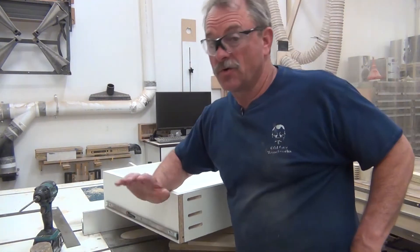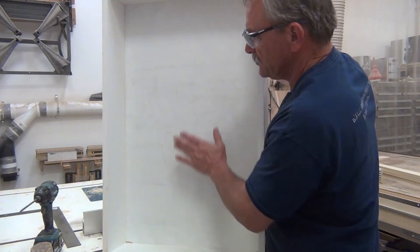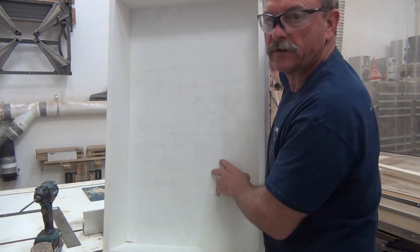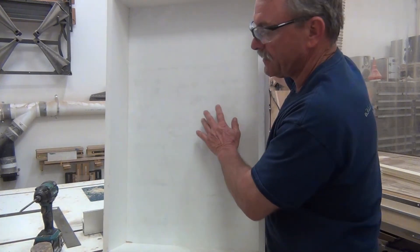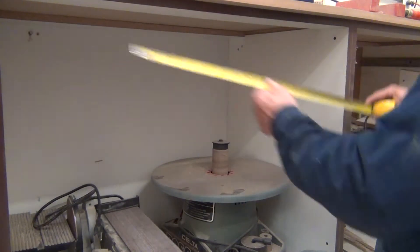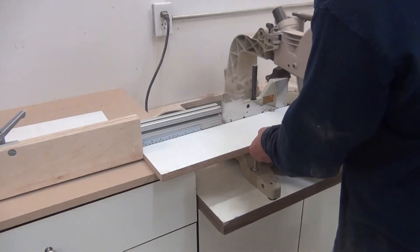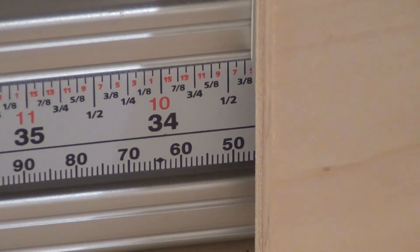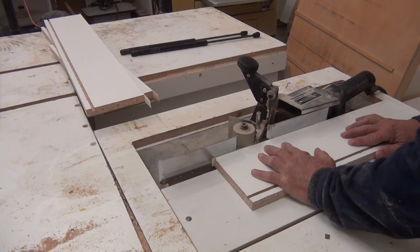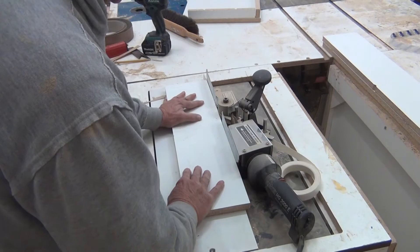This drawer has a quarter-inch bottom, which is probably a little too small. Generally my smaller drawers get a quarter-inch bottom and bigger drawers definitely get a half-inch bottom — I rarely use three-quarter inch for drawer bottoms. Since we're going to put a drawer in this opening, we should measure it first. I rip my parts for height and length — the length can be whatever you want as long as it fits in the box. For the front and back, we subtract one inch for the hardware and an inch and a half for the two sides. I put a little white banding on it just to make it look clean and nice.